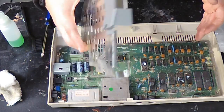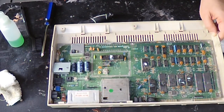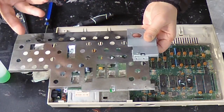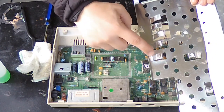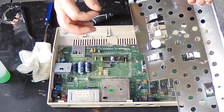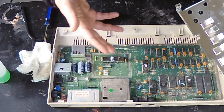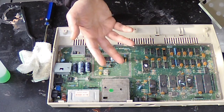This is some of the most gross-looking shielding I've ever seen — there's just a tremendous amount of dust in here. I'd be surprised if this thing worked at all. It's really caked on on these little tabs, and that's really bad for the heat sinking. You see all of this dielectric grease? That's non-conductive silicone thermal paste with little tiny particles of metal in it — it conducts thermally but not electrically. Pretty much all of it is dried up, so you need fresh goop on there to give adequate heat flow. That could certainly contribute to chip overheating and burning up.